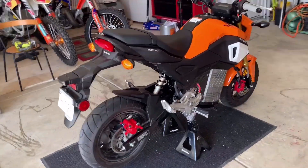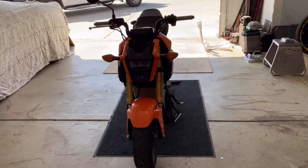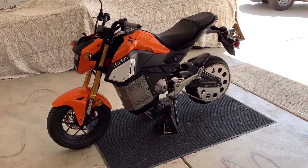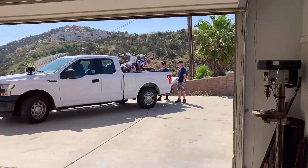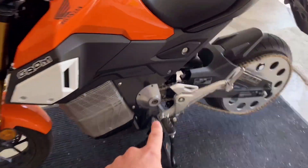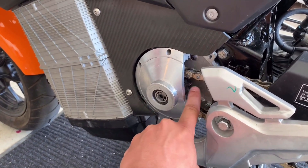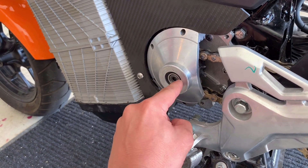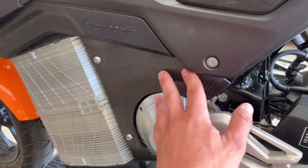All right, here it is. Let's take a little walk around before we check out any of the details. Look at that sprocket! So, Mark made this — this is freaking amazing. Not only did he make that, he made the sprocket. The splines on this motor are super unique, so he custom made the splines for the sprocket. He made it so that the bearing supports the end of the motor shaft. I got him this carbon fiber and sent it up with the sprocket and a couple other bits, and he modified it to support some of the load and also look totally rad.